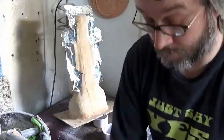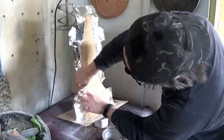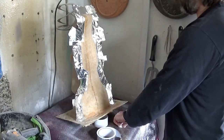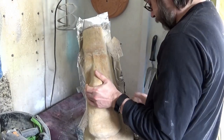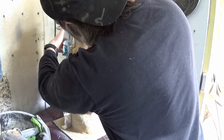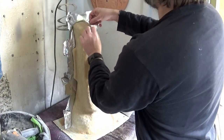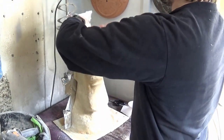Sticking the tape in place to create the seam. I actually thought at one point I might have had to turn this into a five piece mother mold but I thought we'll probably get away with three pieces. There we've done the back of the model and now we're going to run a seam through the center of the Easter Island head face, just increasing the depth of the seam just underneath the ears. Now we're going through the center of the face and the center of the model as evenly as possible.